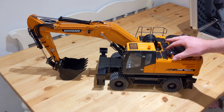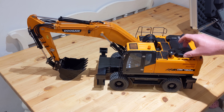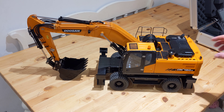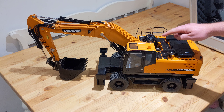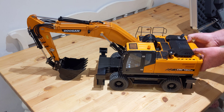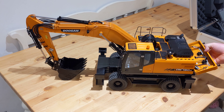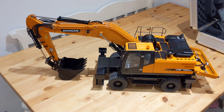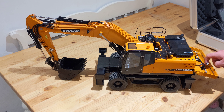From the last video, after the electronics, I literally screwed in the tray that holds all the ESCs in and tidied up all the wires with cable ties. The slew wiring I left full length and just cable tied it all in. There was no need to shorten any of the wires. It's quite tight in there, but it wasn't horrendously tight. And then in the counterweight, this pulls down — I tidied all the wires up in there, just super glued the wires down onto the counterweight itself, and then keeps it all nice and neat with some shrink wrap.